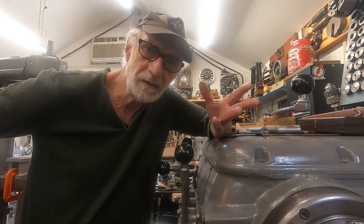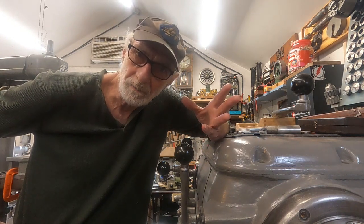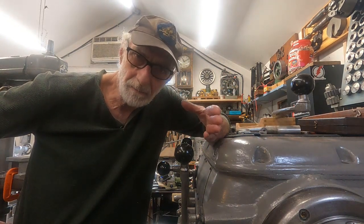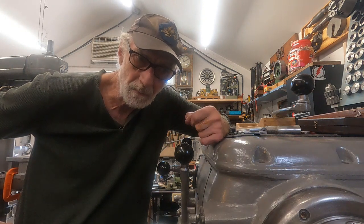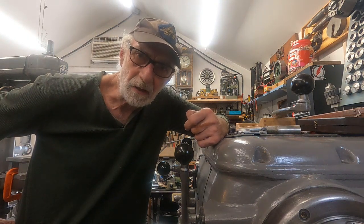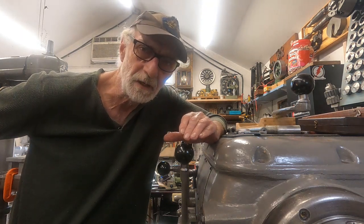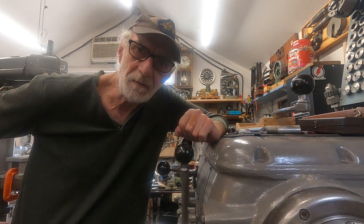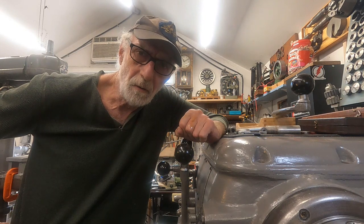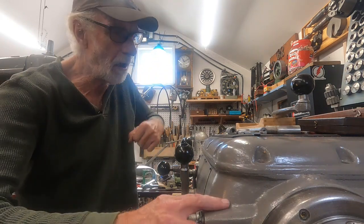I'm working on some microphones so I can talk over this antique equipment that is exceptionally loud. I'm going to take a cut on this piece of — it's like 4140 or something scrap — and I'm looking to see how a nose radius of three sixty-fourths of an inch will do on this piece of metal. The feed is 0.0027 and the RPM will be 850. Here we go — loud.